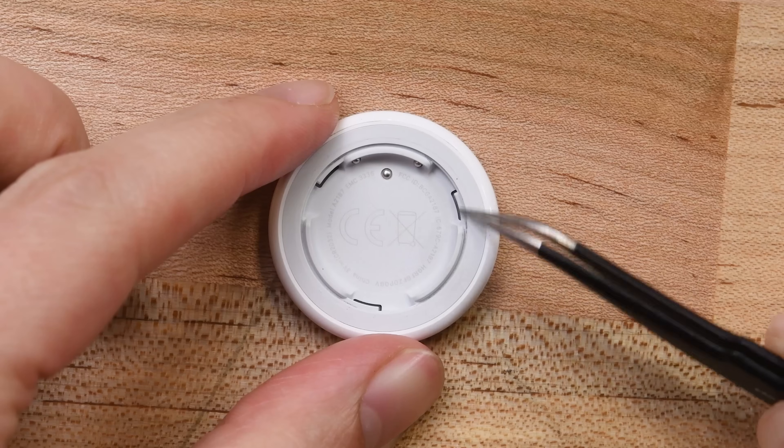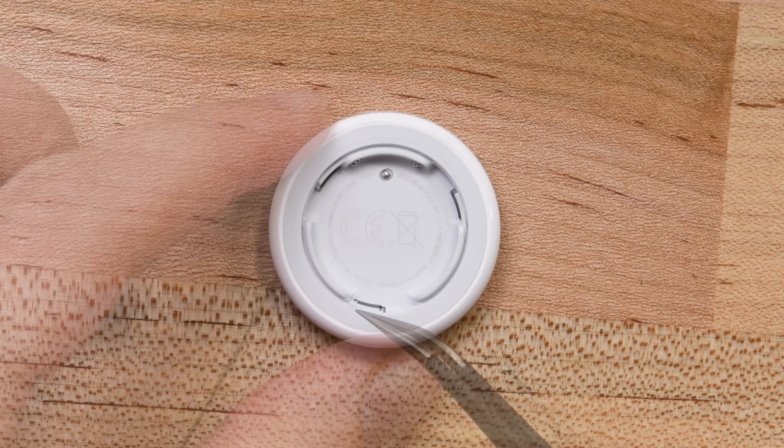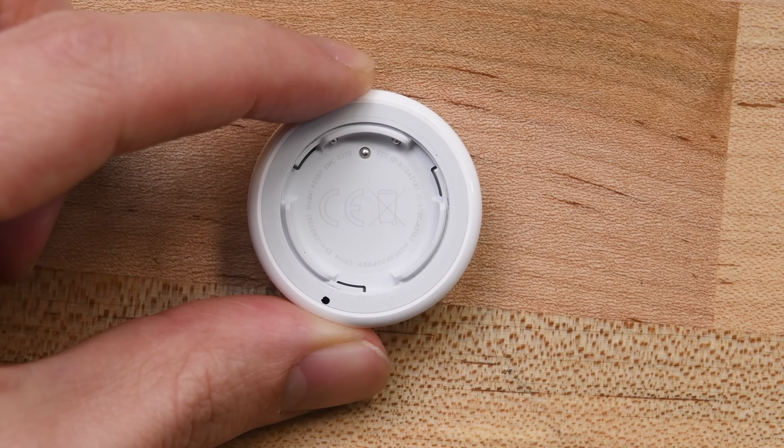That's where we want to drill. The best way to find one of these spots from the outside is to use the battery cover clips as a guide. Our favorite spot is roughly at 7 o'clock with the tag oriented so the CE labeling under the battery is upright. You can see the hole for the battery cover clip starts at about 6 o'clock and ends at 7. Mark a spot at 7 o'clock here at the very edge of the gray battery cover below the clip.